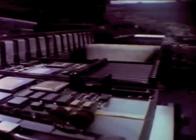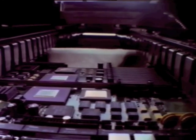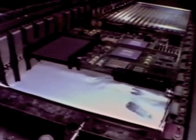The board arrives at the Wave Solder Station. Simply, it's Niagara Falls, with 700 pounds of 255 degrees centigrade molten solder. But before the through-hole components are soldered, the board is deoxidized with liquid flux to ensure high-quality bonds. Then it's over the falls.